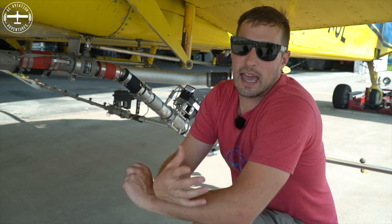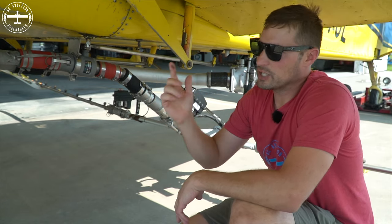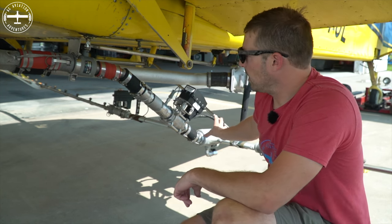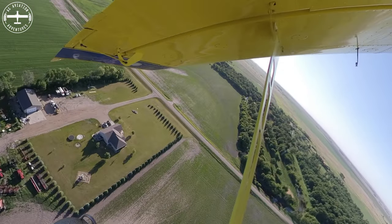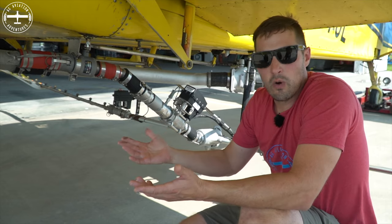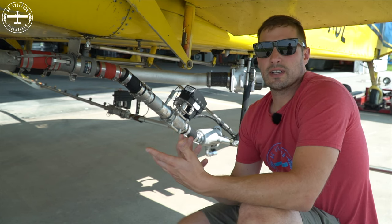And that is keeping everything agitated. Sometimes if you're not agitating, things will start to separate. So once the product goes into the airplane, I have the pump running, everything's agitating, and it stays nicely mixed. When I pull the handle up and stop spraying, this diversion puts a small amount of negative pressure on my booms so that I'm not leaving anything dripping or drizzling. That's pretty important, especially if you're near a town or pulling up over someone's house. By putting this slight negative pressure, it helps so that you don't ever have a scenario like that.